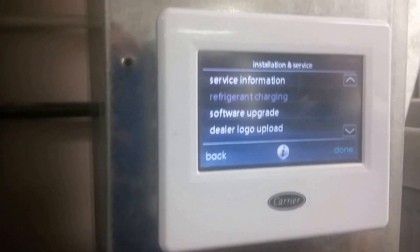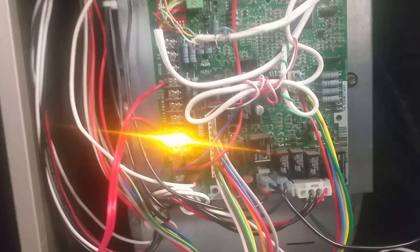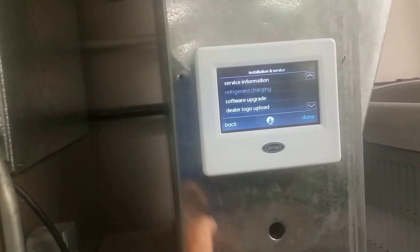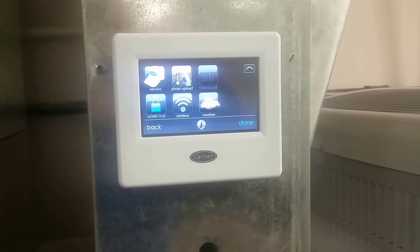You've got to make sure these are hooked up right — that's the whole purpose. There are other reasons to hook up the G terminal: for airflow, for dehumidifiers and things like that. If you have questions, reach out and ask. Don't trust any float switch operationally — check it, make sure it's wired in. A lot of times you'll find techs just tuck the wire into the equipment and it's not doing anything. This is critical. This applies to Infinity Carrier systems specifically — on other systems we still break the R terminal standard. This is the proper way to hook up the G terminal shutdown for all Infinity stats, including the in-style. If you're installing a float on a unit that's been in for eight years, you'll have to enable this — if you don't enable it, the float you just installed will do nothing except sit in the pan and look pretty.